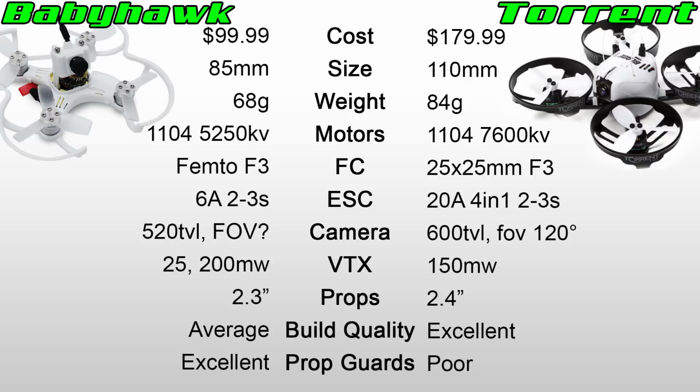And I really like that, but it's the 25 by 25 millimeter spacing, which is a very odd size, and I feel like that was completely unnecessary and adds more weight. ESCs for the Baby Hawk are single 6 amp ESCs, while you have a 4-in-1 20 amp ESC, as we saw in the BLHeli Suite there. But they both have the same cell ratings. I know it doesn't say that the Baby Hawk is capable of 3S, but I fly mine all the time on 3S, and it does just fine.